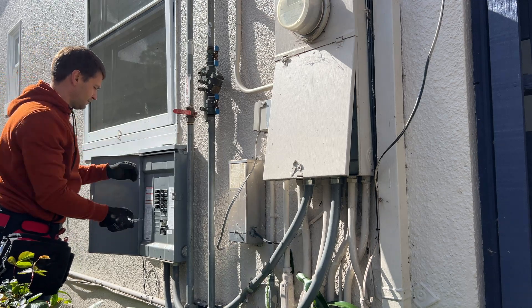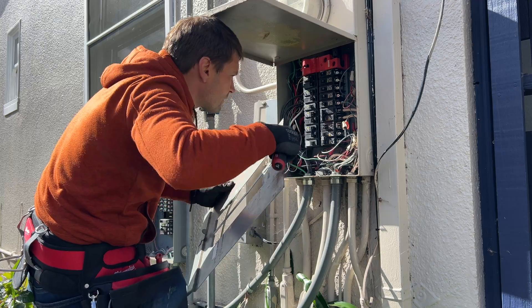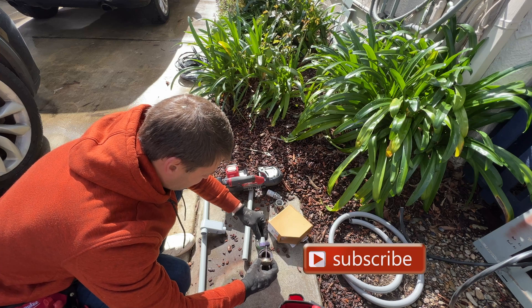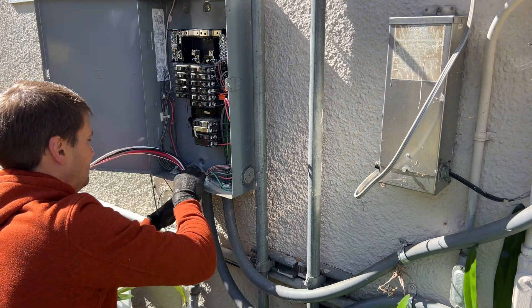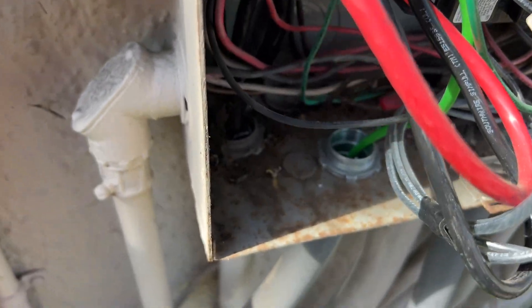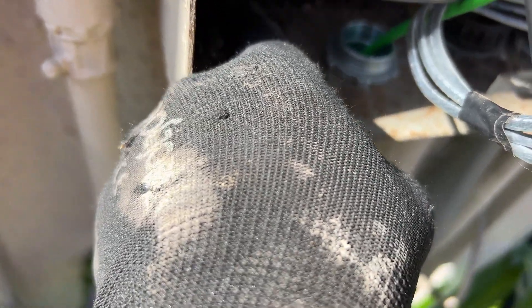Now that wiring for the inverter is finished, I can start wiring the electrical panels. On the left side we have the electrical panel that was backed up by a generator with an interlock, and on the right side is the main electrical panel. Also, just a quick tip: whenever you are working on electrical panels and you see something strange or incorrect, fix it. For example, right there someone dropped a self-tapping screw and left it there. In general it's not going to cause harm, but it's better to remove it.